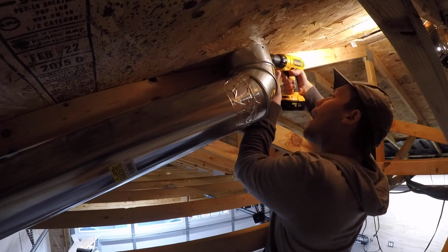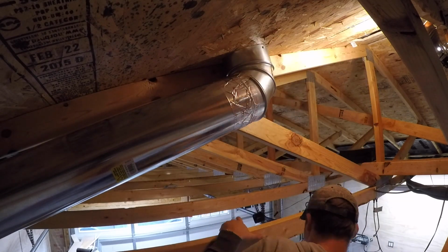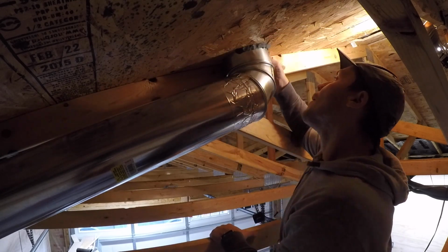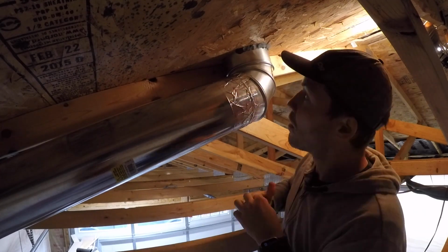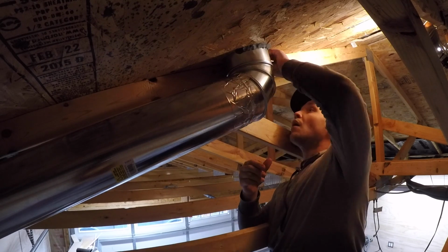After this, to fully seal it up so I didn't have trace amounts of smoke leaking into the attic from this admittedly imperfect joint, I used a product called Duct Seal that I had left over from installing an outlet on the outside of the garage. It's a non-hardening clay-like compound that you can form to the area you need sealed and press right into place. And it sticks to most dry surfaces without issue, including the wood sheathing on my roof.